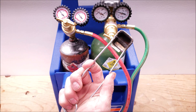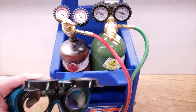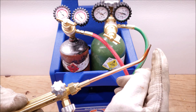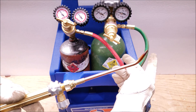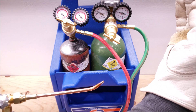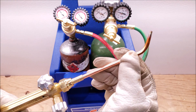Get your striker out and get that ready. Also go ahead and put your gloves on and your shield. Make sure you're wearing approved welding glasses that are properly shaded — not just sunglasses. Be aware of where you point your tip, especially not toward your hoses, because that would be a very dangerous situation. Also remember the heat projects a far distance, so you could accidentally melt something you're not meaning to.